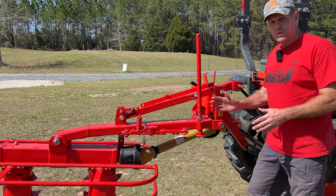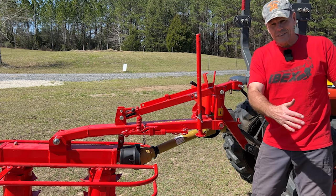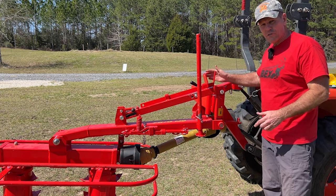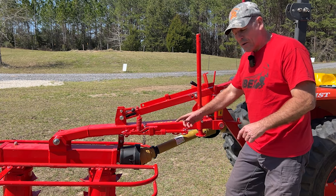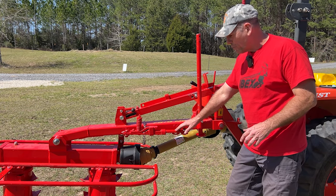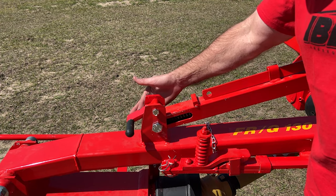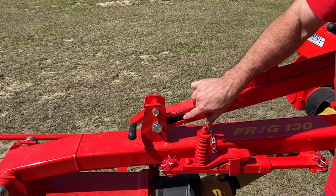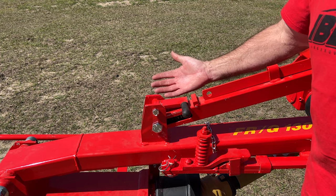I've already got the mower in the transport mode, which is directly behind the tractor. Later we'll show you that it swings sideways and actually cuts next to the tractor. To put it in transport mode, there's a lever over here that we'll show you in a minute. This breakaway bar is stowed here in transport mode and in operation mode it'll actually attach over here. We also have this stop here that you have to put in transport mode — normally when you're cutting the stop will be back here and it'll allow this mower to float up and down on this spring, but in transport mode you'll put it here so that it'll limit the travel when you're going over bumps.